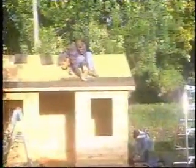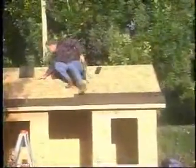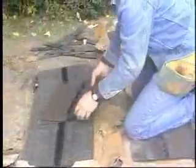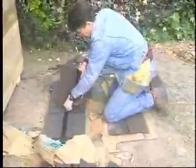While one person is shingling the roof, the other person can be cutting the caps. Caps are the last row of shingles that are placed along the top ridge of the cabana. Using a full shingle, make a V-type cut from the edges and 2 internal seams of each shingle to the top of the shingle edge. If you have done this properly, you will get 3 caps from each shingle.